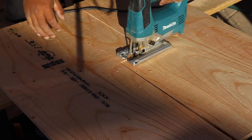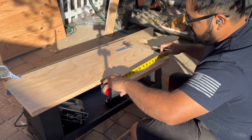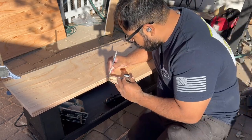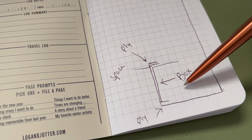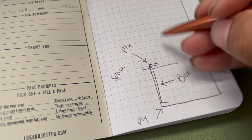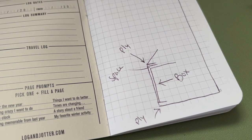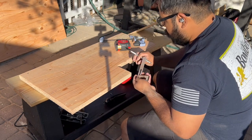After roughly cutting the plywood for the sides, I come in and separate the pieces with my jigsaw. Right now I'm measuring so my little IKEA box would fit — the cubby plus a little bit of space, plus the plywood on top and plywood on the bottom. Then I connect that point to the top of that box and cut that triangle out.